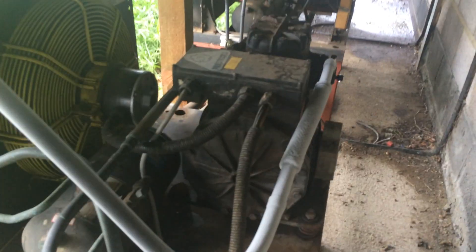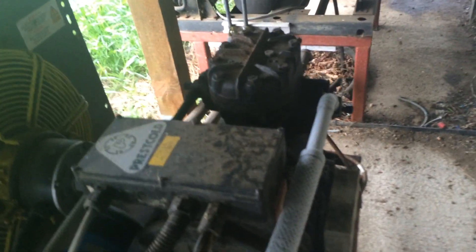Customers reported this unit was iced across the area of the ice builder. As you can see, it's all the way back to the compressor. The second unit, which is on the same ice builder, is actually stone cold. I think the only heat in the bottom is possibly off the crankcase heater, so we've got power to it. It's not running.